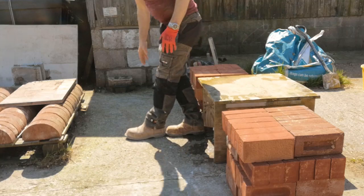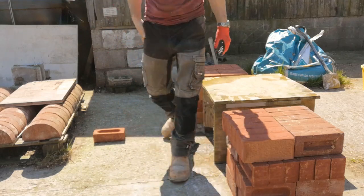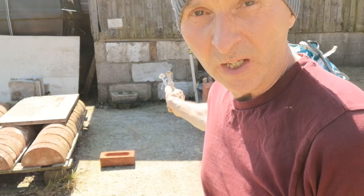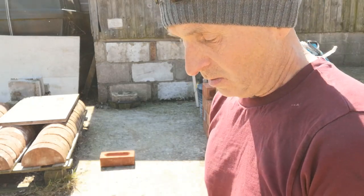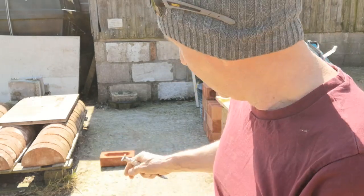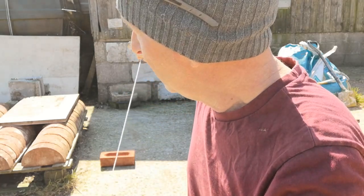Two foot away, and this is where I'm going to build my wall. I have seen some students when they come to do a long wall - sometimes they've been told to draw a line on the ground on the concrete for your frontage line. You would never do it on site, because more often than not, especially in England, you'll be on a damp muddy finished surface. In workshops you have lovely smooth concrete floors and you can draw on them, but you'd never do that on site.